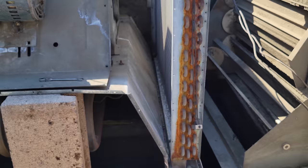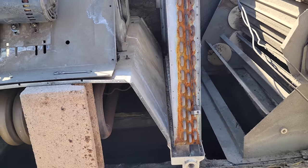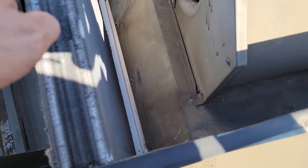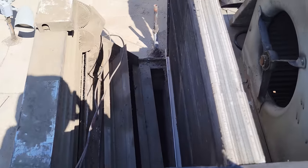We just need to lift up on the evaporator coil and pull it out. The evaporator coil is still connected on the other side but everything's going to flex. These aren't fun — it's a chore. I have to stand up in the compressor section to get these two screws. We got them. Now we got it all screwed in and we just got to center everything. Quote these things as a two-person job or you're going to be miserable.